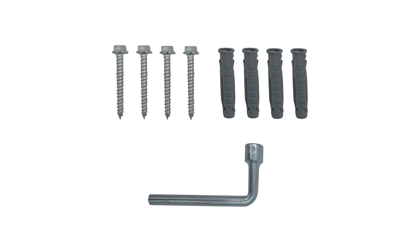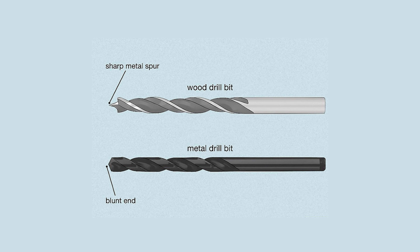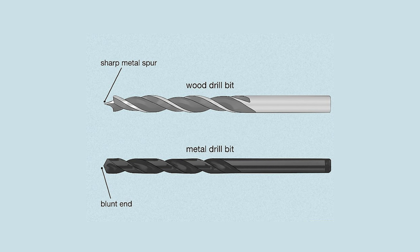Now, if you're mounting into concrete or brick walls, you'll need to use concrete anchors — these are typically provided with the mount. Here's another tip when you're struggling to get studs on both sides of the mount: if there's a stud behind where the mount is going but there's no slot for the lag screw to go, you can simply drill a hole in the mount itself. Just make sure you're using a drill bit specifically meant for metal — a wooden drill bit isn't going to work for this, or it may work but it's going to dull the tip out and really not be useful in the future.